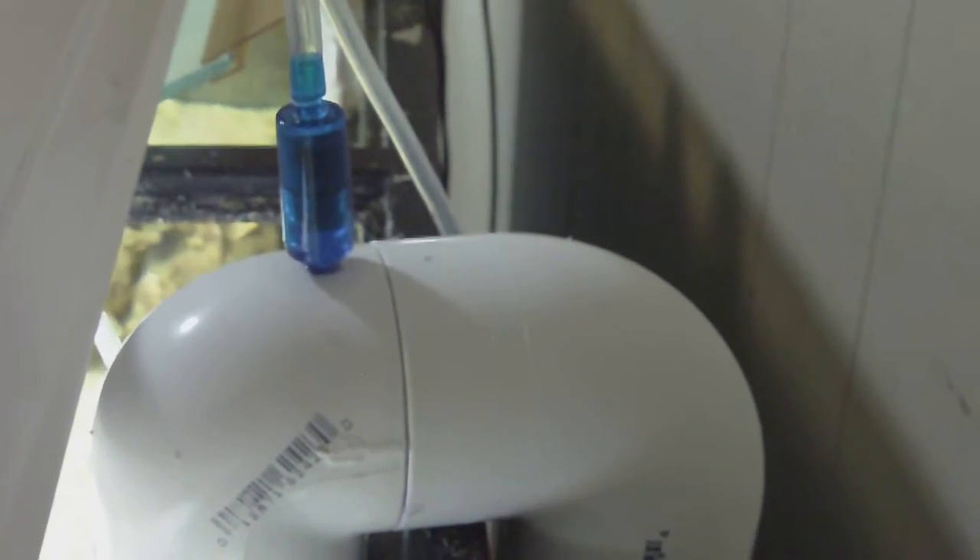You can see there's the overflow. It goes down and does a loop, comes up here. It's got this to bleed off the air out of the top of it. And it simply goes down and it's got the double loop and then it's got the air hammer right here to help keep it quiet. And from there it just goes down to the bottom of the tank.